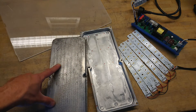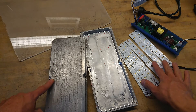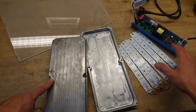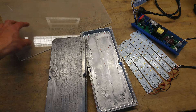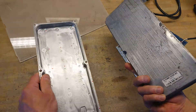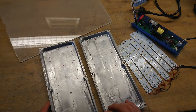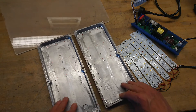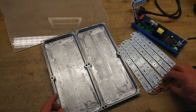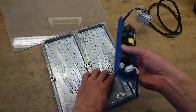Here I have two shields from a base station amplifier. I have a LED driver with associated six boards, each with five 1W LEDs on it. So this is a 30W LED street lamp, and I have a diffused piece of acrylic from an LCD monitor. My idea here is to take these two shields and use them as a heat sink, as they have an even surface on the inside. I'll maybe just polish that down a bit, then take a cutout in the middle for the driver to pass all the way through, and mount the six light strips just like that.